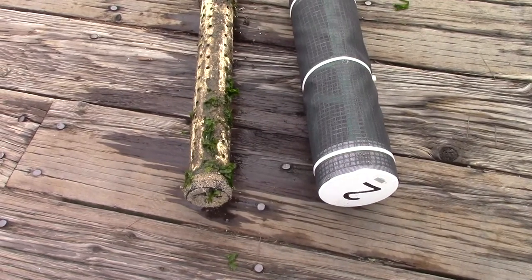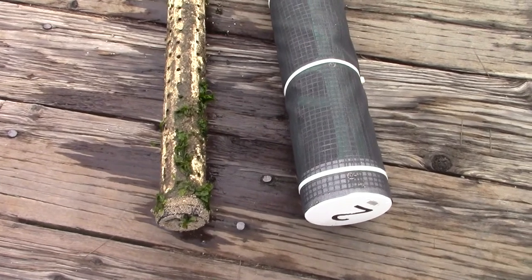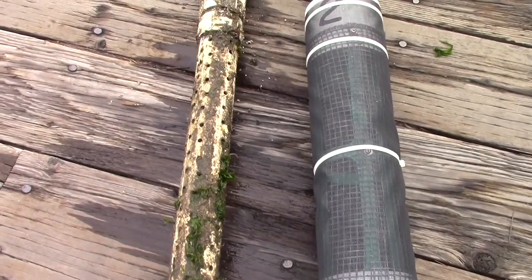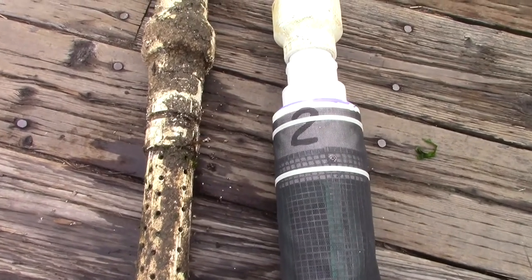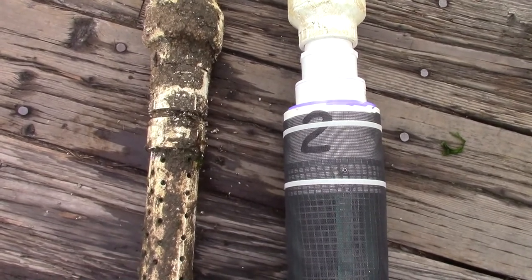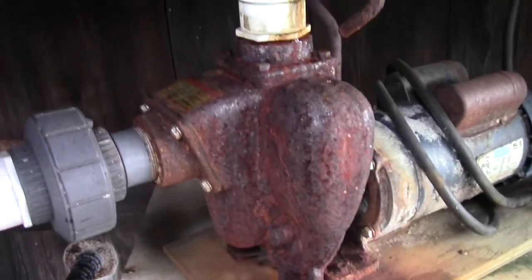The end of the three-inch hose line has an end cap, and there are a couple of variations of end caps that are used. The end cap on the left here is our traditional one with quarter-inch holes, but unfortunately it does have a tendency to clog, especially in the spring. So we've been testing some different designs and have come up with the one on the right. It still uses quarter-inch holes, but since the surface area is a bit more broad, we are able to use a sturdy screen to help prevent clogging. Both end caps use a check valve to prevent the water from draining.